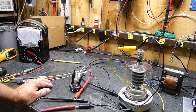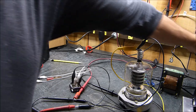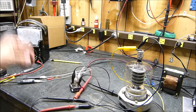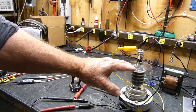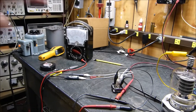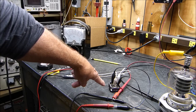It's about how you strap the grid and the screen together and then connect them to the plate. I've got a good tube here, another good tube already tested, a third good tube in the radio, and this bad tube — it says 'bad' right there. In a nutshell, you're strapping this thing as a diode — grid, screen, and plate all together — then putting a varying voltage across it using a variac, no transformer between it.